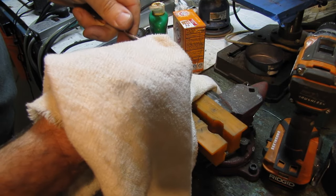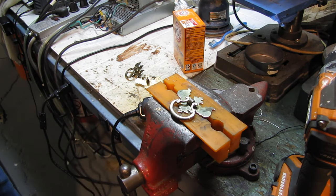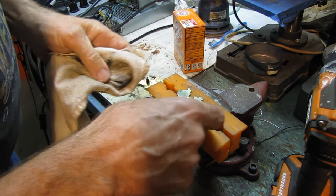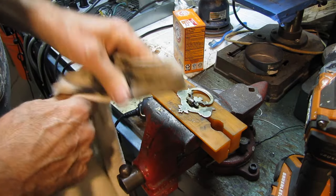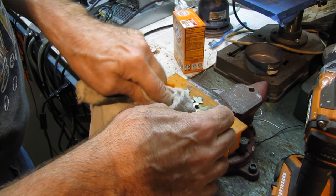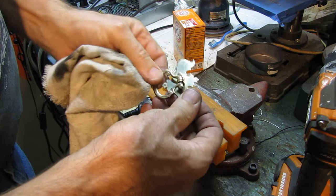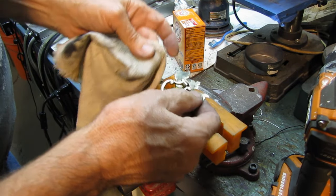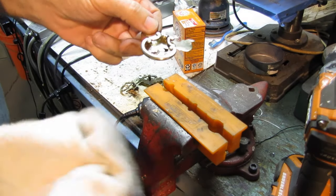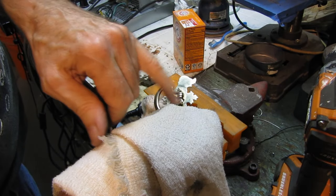I'll do the same thing to the drawer pulls. The drawer pulls came out pretty good. I didn't leave them in there long — it was just a few areas where there was some pitting or corrosion, and I used the copper to fill it in. The brass actually was in better shape than I thought underneath the finish they'd sprayed over it. They'll need a final clean just before I put them on the cabinet, and then I'll give everything a coat of clear lacquer so they don't oxidize.